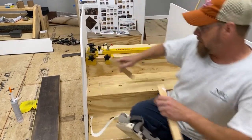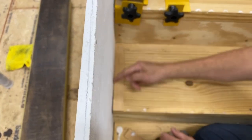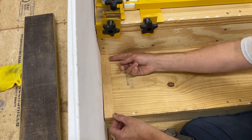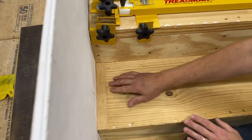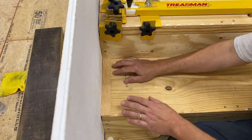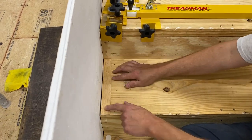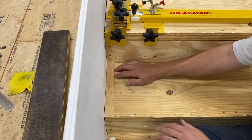I'm going to do a small straight down right here. See this? This wall right here actually sticks out in the center. Look at that play in that wall right there. Now, if you put your traditional stair scribe right up against this, somewhere you're going to have a gap either in the back or in the front, because it's a solid side on your stair scribes. All of them are like that that I know of, except for this one right here.